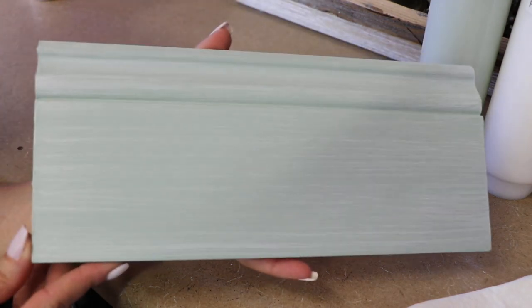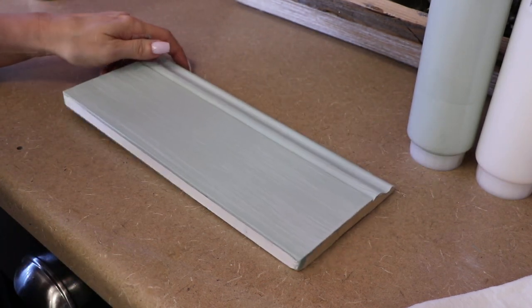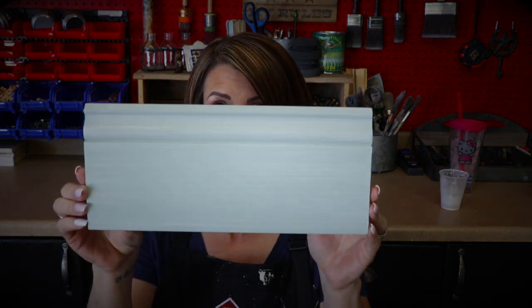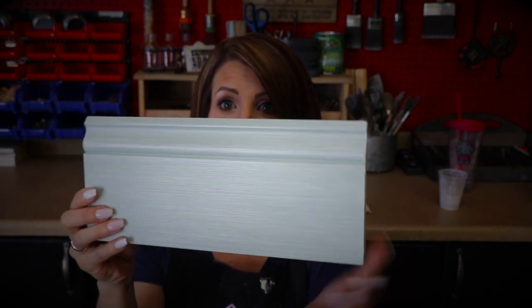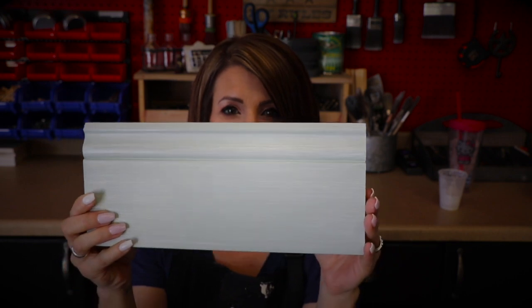That is our final piece. I'll show you up close from a different angle so you can get a really good peek. That's how easy whitewashing is, and it's really fun — it adds just a soft effect. This is our board, completely whitewashed, cleared, and ready to go. You can see that wax puts back that really nice sheen and gives it just that little bit it needs after the sanding. I'll feature a still of this at the end so you can see really up close how it looks.